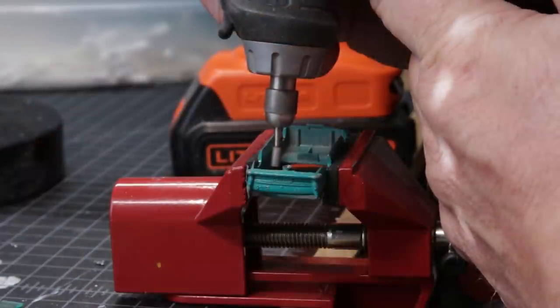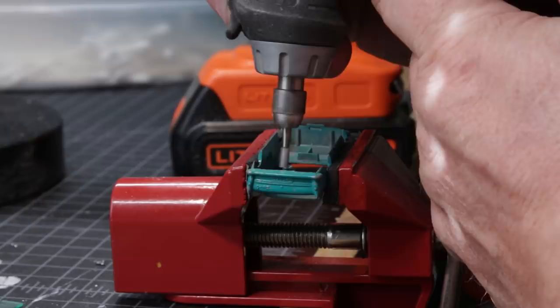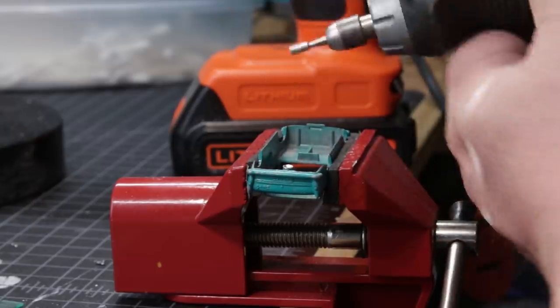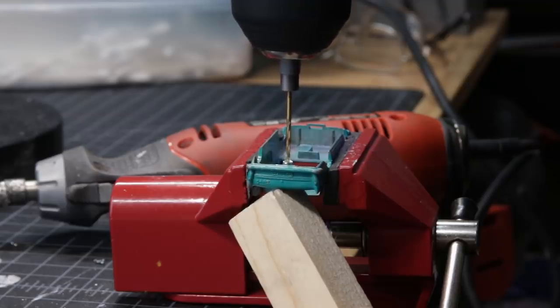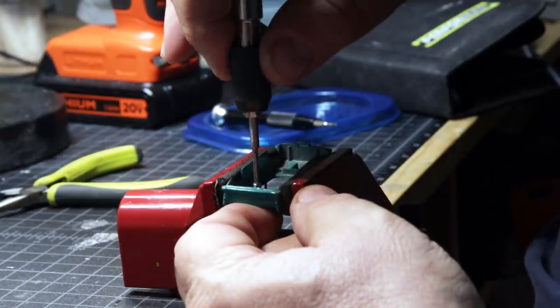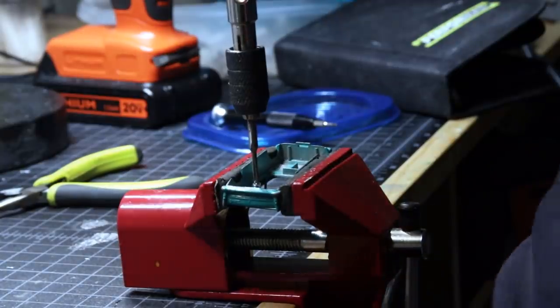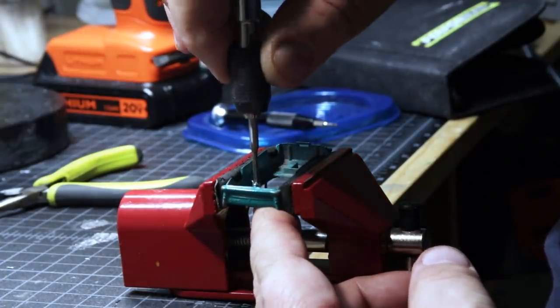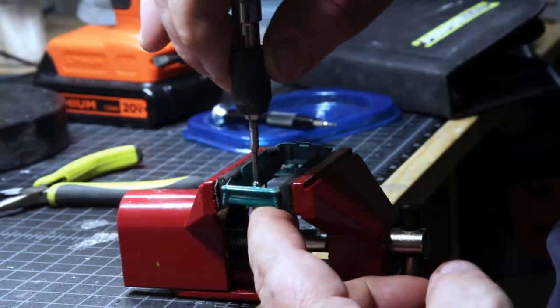This particular casting is pretty easy. It has one post and then a little tab in the front, and I'm going to clean up the burr around the edge of the post so that when I put it back together it'll go a little more smoothly. Then drill out the hole, or the button screw. After that it's just a matter of tapping the hole and following that up with a button screw.